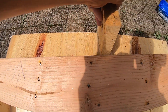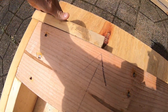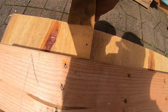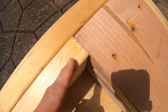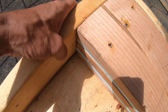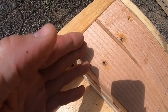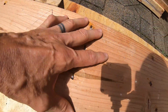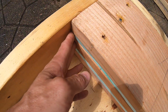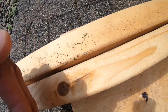Joists or trusses on two-foot centers might have one or two bearing weight on the header, which then transfers that weight down to the jack stud. I've seen people doing remodeling work who have headers in walls with no jack stud underneath. It doesn't matter how big the header is — even a tripled two-by-twelve — if you've got no jack supporting that end, it's eventually going to crush down. You need a jack under there transferring the load down to your bottom plate.